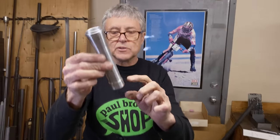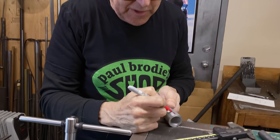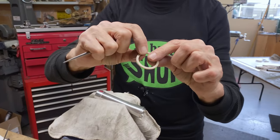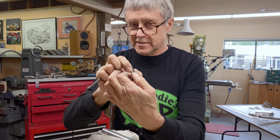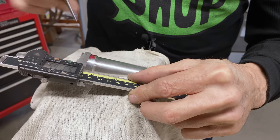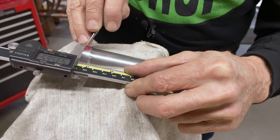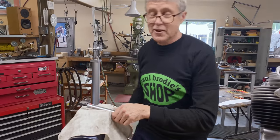So that's what it's looking like now — this shoulder got made a lot smaller. Let's go to the vise. I'll hold this really carefully and we'll make a mark here. I'm going to put my red Sharpie felt pen on there right now. I've got an O-ring that goes on each end, so these have to be squished a little bit. For these two O-rings I've allowed a 50 thou squish, which is a little less than a sixteenth of an inch. I was estimating and guessing — we'll see how that works out.